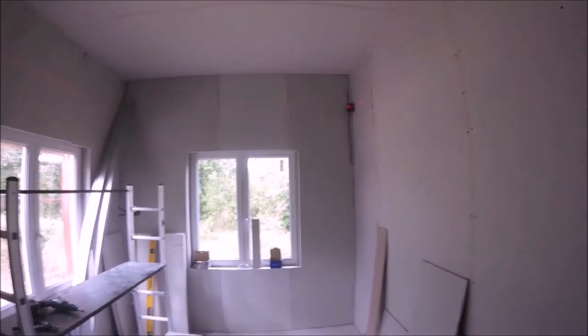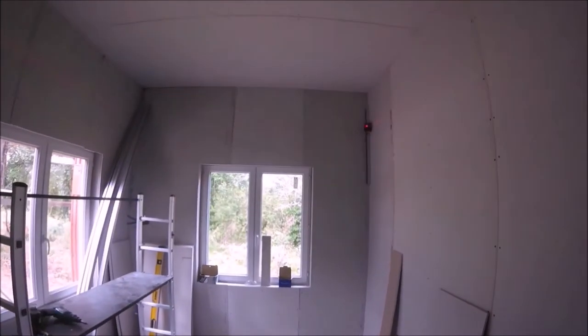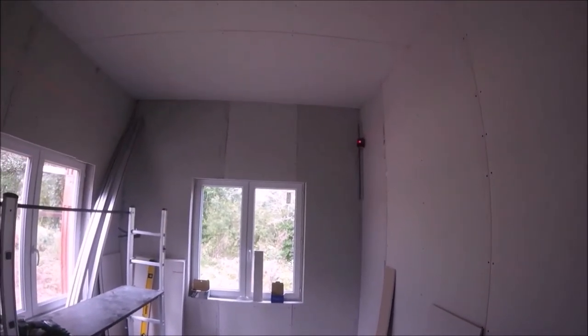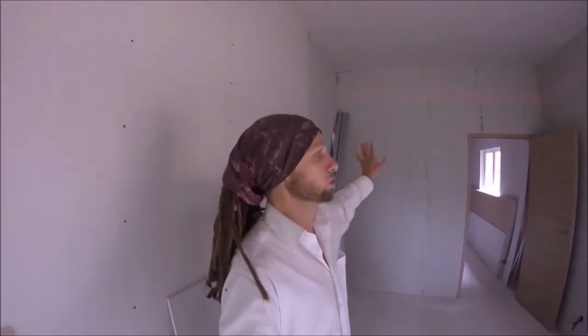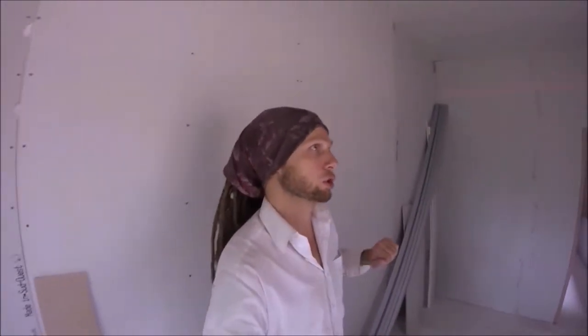So to start off with, you select a height. My height is 254 centimeters. That's to allow for the flooring, and to allow, when it's all in place and all plasterboarded, the 2.5 meter lengths of wood that we're building the wardrobe out of to fit in there snugly with no issues. We've allowed a couple of mil tolerance.